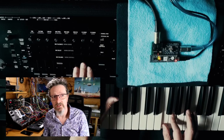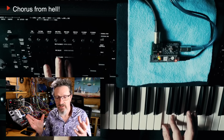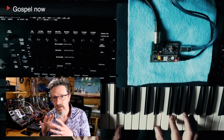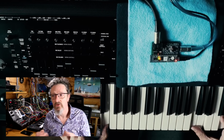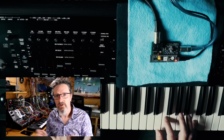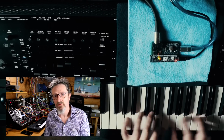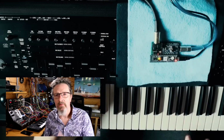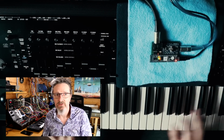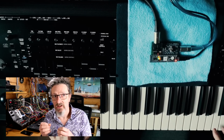It's got 64 voices, 2 parts, you play 2 sounds at once, 6 operators. It's the real deal. I mean, obviously there's no display, there's no controls or anything of any kind. However, the whole FM engine within the XFM2 is completely MIDIfied and mappable to MIDI controls or whatever you like, either via regular MIDI or via SysEx. You can get down and dirty to up to about 300 parameters if you so wish. I mean, undoubtedly some kind of librarian editor, some software editor for it is going to emerge, or some other way of using it just to dig in further, because this is remarkably cheap.